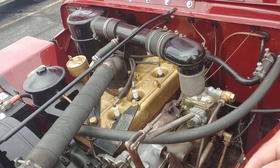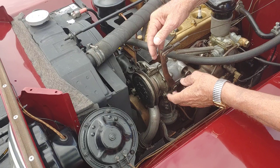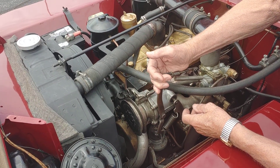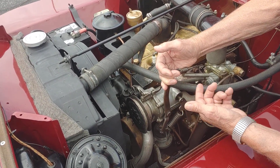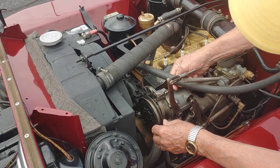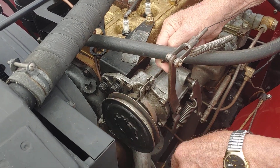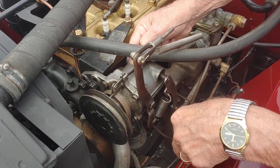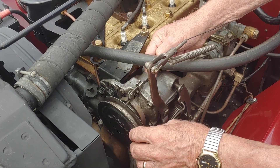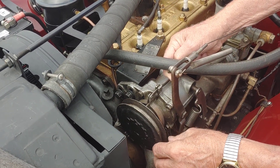Explain what this is right here. Okay, this is the governor. Inside there's a lever — you could adjust the governor's speed by pulling the lever farther, and you engage the governor by this lever here. It's actually engaged right now. It may be hard to see, but there it's not engaged. I have the belt off of it because I'm not going to use it, so I just don't want it running all the time.